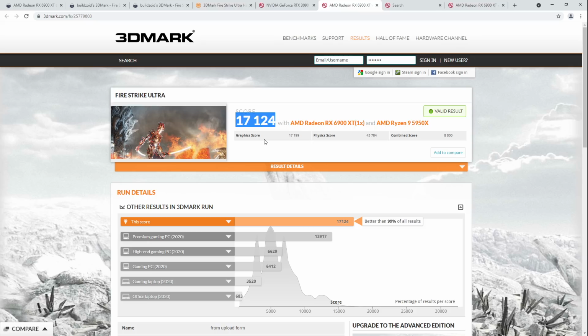And that's basically why I probably won't be getting another 6900 XT, even if they were super cheap. Because these cards have a lot of issues on liquid nitrogen. For one thing, on my card, there's a cold boot bug at minus 75 degrees Celsius. Basically, if you try to start the card at less than minus 75 degrees Celsius, it just won't start. It literally will not start.